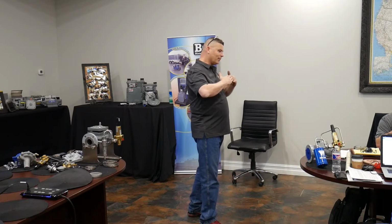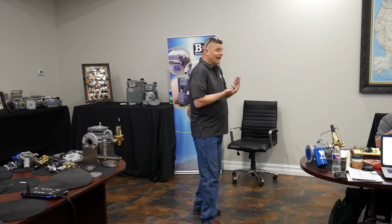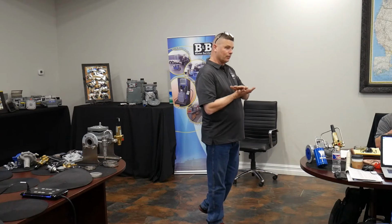If it's a shallow pressure cut you're making, and you have something that will flow a little bit of gas when there's just the smallest amount of differential pressure, then you're going to at some point experience lockup. I mean, if you had infinite turn down, you'd have no lockup. So you've got to understand and do the right thing for the process conditions. Okay?